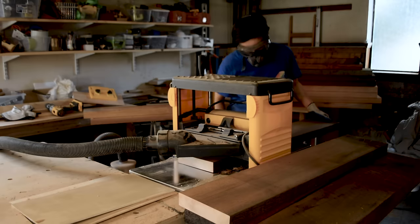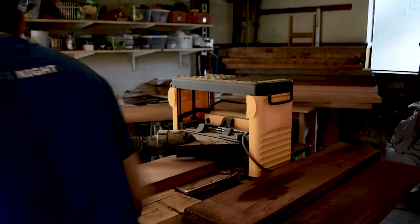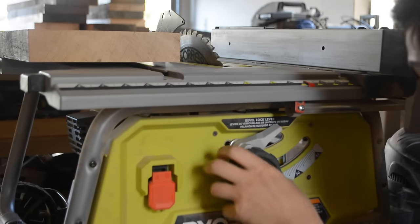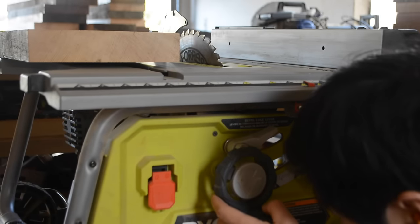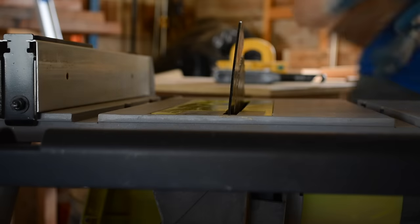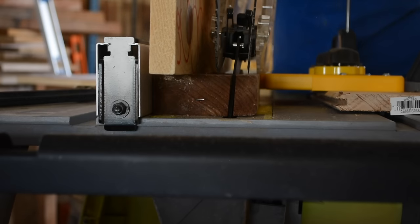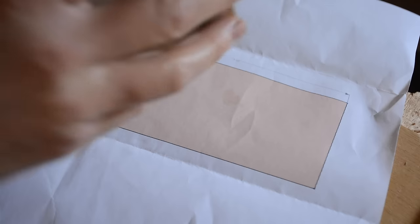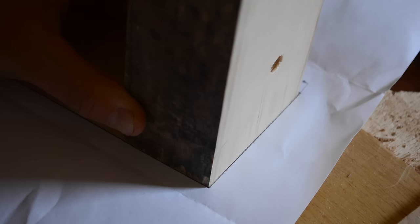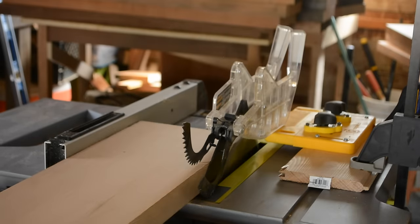Back in the shop, I'm getting ready to cut a bunch of staves — I have to make 54 plus a few extra. I start by planing the board smooth. The staves will each be cut like a trapezoid with edges that are about 3.33 degrees in from a 90 degree angle. I use Google SketchUp to determine the number of staves and the angles. Many different combinations of angles and number of staves will work. I cut a few scrap pieces and measure the final angle against a printout of a 3.33 degree angle. I cut an angle off the far edge of each piece. From each 2x8 I will get two staves.